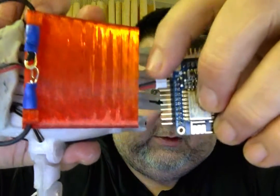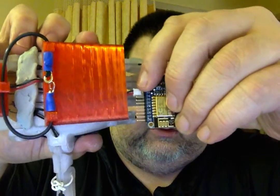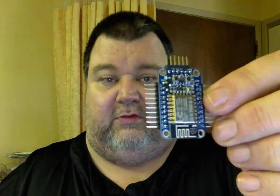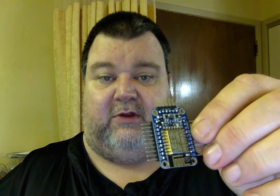The battery connector is this little JST connector here that connects to two of the header pins. So I can just hold that connector and disconnect the module. And there we have it. There are going to be some resistors soldered onto the one side — the other side is unused.